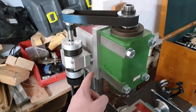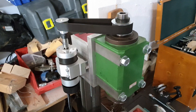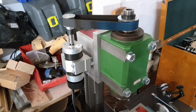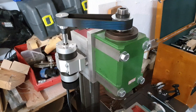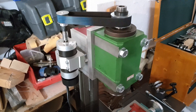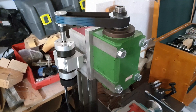It took some time to get the right tension on the belt. I'm still not sure whether this is good enough or not, but it feels like it will do. I had to put some stuff in between here to kind of raise the tension on the belt. Eventually I made a 10mm thick little aluminium stick that I pushed in there, and that seems to be just perfect. So tomorrow I will make a bit of a nicer aluminium plate.